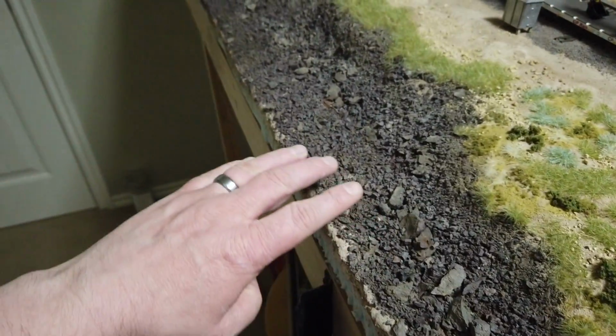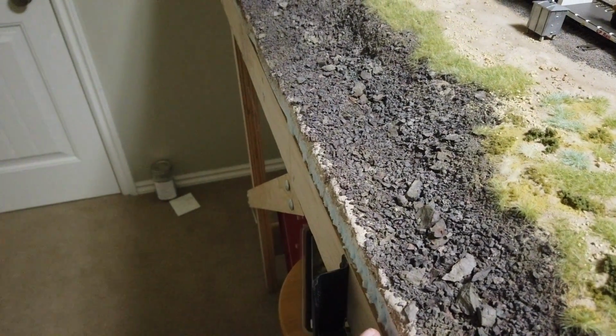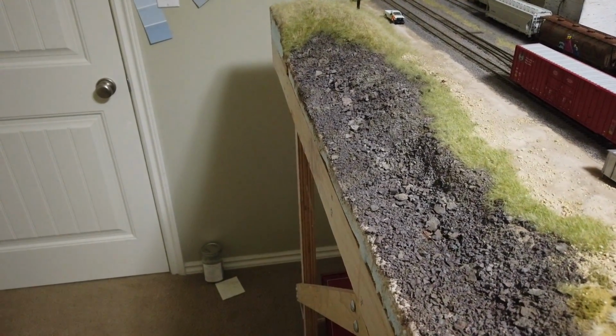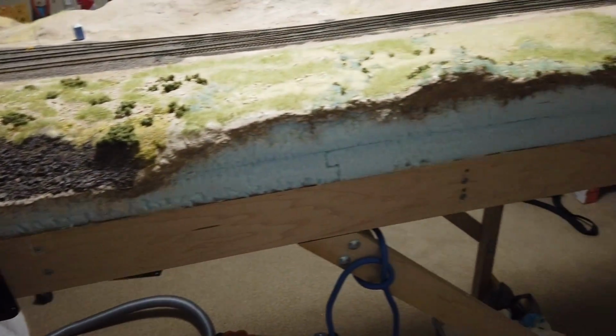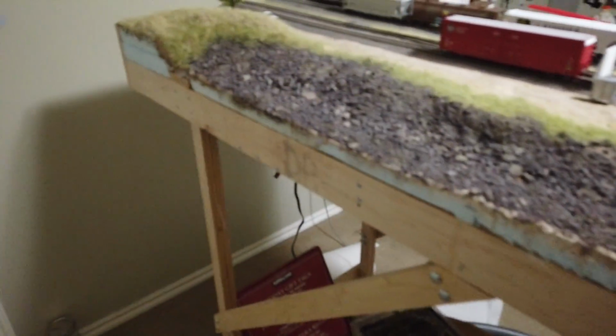But because I'm going to have water here, what I'm going to do is put a bead of caulk, just thin, clear caulking there. Put the fascia on just to create like a dam. And I'll be able to bust that off if I have to get it off, but I shouldn't ever need to remove the fascia on this because it's not blocking anything critical.